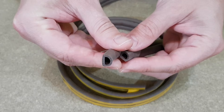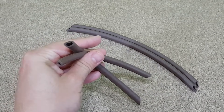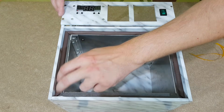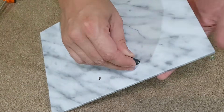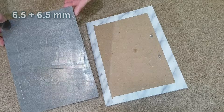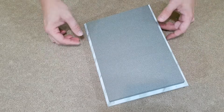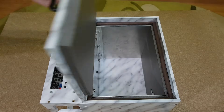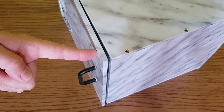But first I want to mount the lid. This flexible seal foam tape is used to seal doors or windows; in my project it will seal the lid. I'll measure the needed pieces and cut the edges at a 45 degree angle. They have a self-adhesive side so it will be easy to stick them in position. I need a small handle for the lid — I've chosen a black one for good contrast. It will be fixed to the panel with two small screws. A 13 mm extruded polystyrene insulation is also added on the interior side of the lid, glued to the panel with a very thin layer of silicone adhesive. I will use two small hinges with screws to install the lid. The neodymium magnets are covered with a vinyl sheet now — you can't see them, but they do their job just fine. The flexible foam tape actually makes a very good seal.